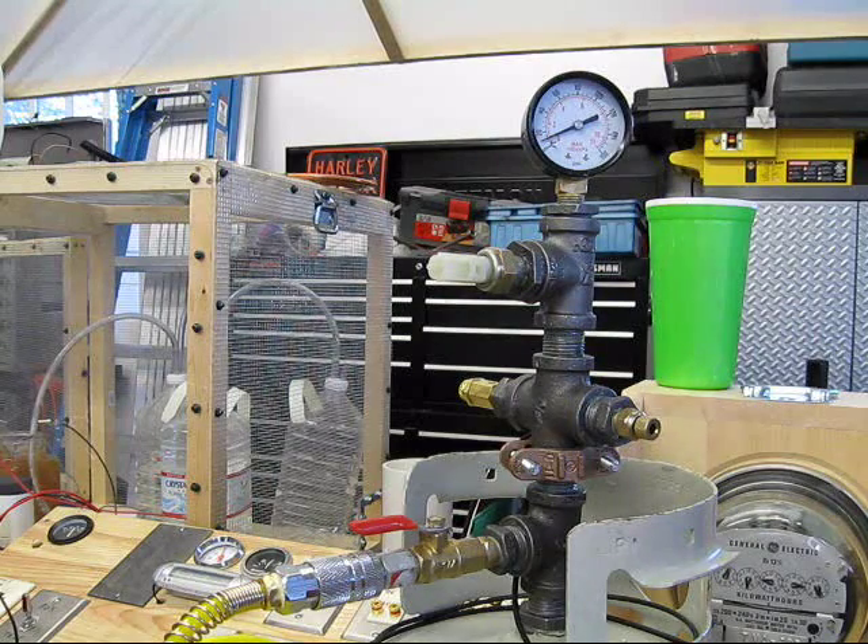The conclusion is, it doesn't take very much pressure to get 20 to 25 pounds. A quarter of a turn after you know the spring has contacted the valve itself is really all you need, and you'll get about 25 pounds at release.